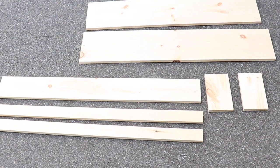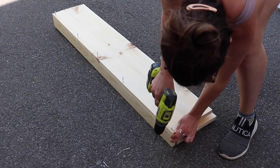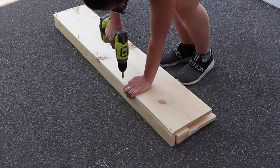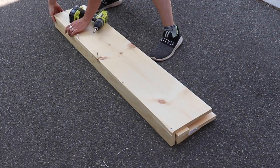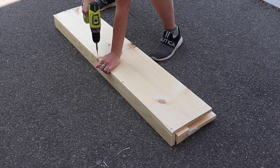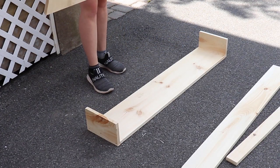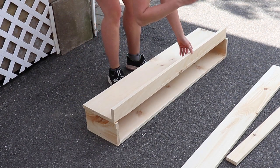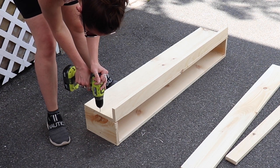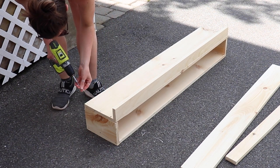Let's get into the DIYs. We're gonna start with the planter box and I'll be pretty quick with this because it's basically the identical design of something I did last year — a planter box slash tabletop for our patio. I'll leave that video linked; it will have really detailed instructions. This one is bigger and obviously doesn't have the table on one side, but it's basically the same. I built the back of the box with the two sides screwed into place, then the front piece with the top piece that goes over the ledge — I just built it in sections.